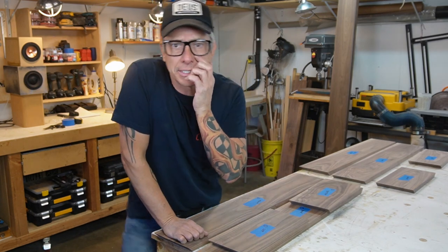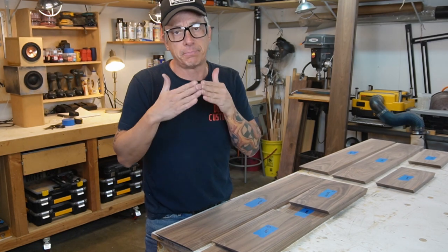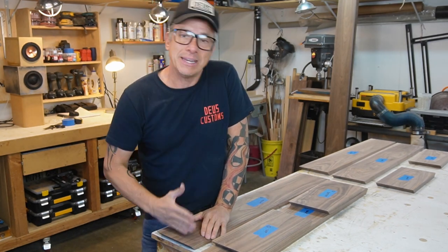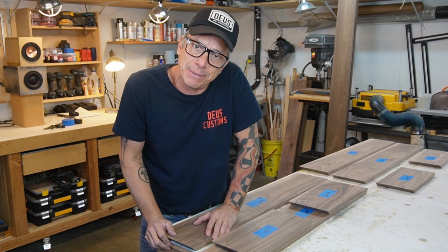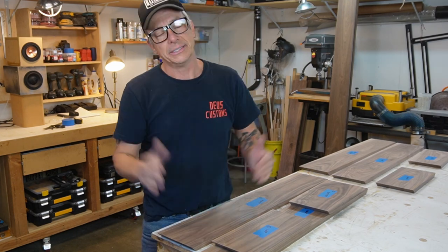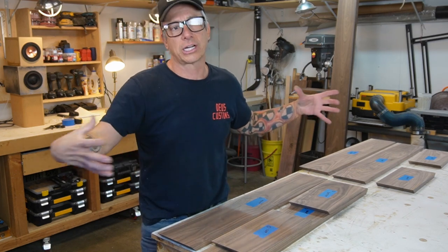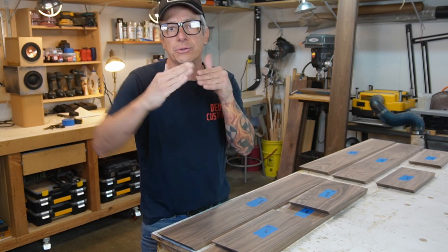I wanna tell you guys another thing. It's very tricky to cut 45 degree and have it perfect because first, this cut gotta be 90 degree perfect, all squared. So your tools gotta be adjusted. Please adjust your tools. If it's a little off, your box is gonna be all crooked and the whole thing is not gonna close perfectly. It's not gonna glue. It's gonna be a little open, a little twisted.